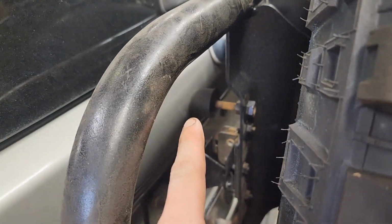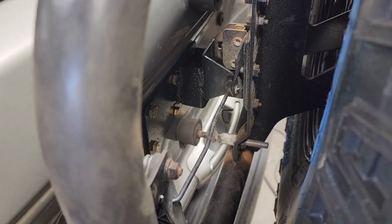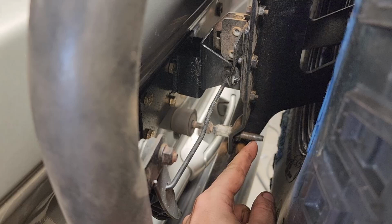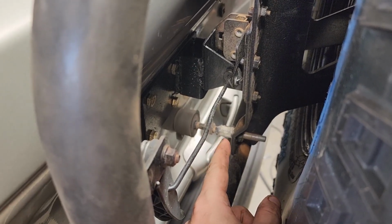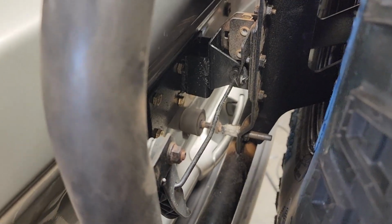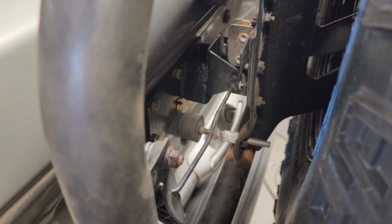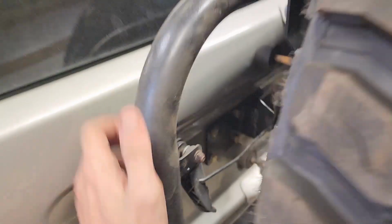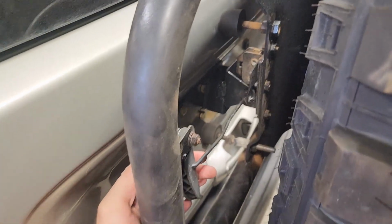See, I've got the top bumper up against there, the bottom one, oh my gosh, there we go. The bottom one, I found I had a threaded rod that was the same thread pitch, and then I used a shock bushing, the metal sleeve inside the bushing, to extend that, because it really doesn't need to be all that strong, it just needs to press up against the body. So got that on there. You can see it's fairly rigid. And then it just works like normal.